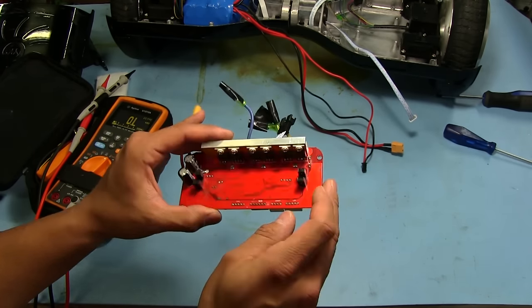We should probably hook up the, I mean, I still gotta fix the charger, which I'm probably just gonna end up replacing that LM358 on and see if that takes care of it. I guess once it's putting out 42 volts, it should probably be fine.